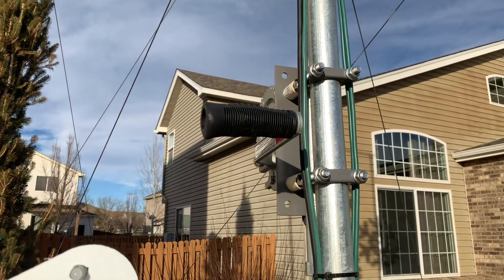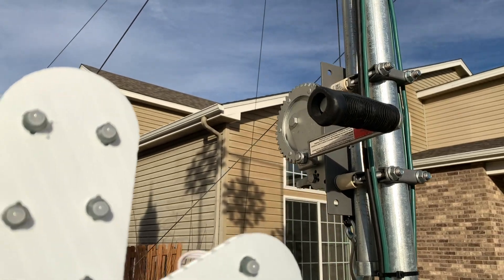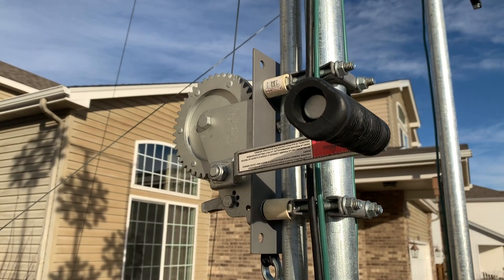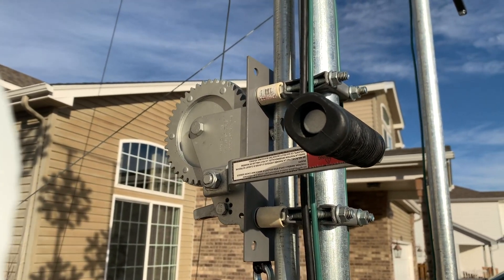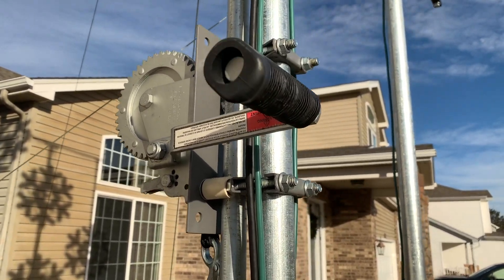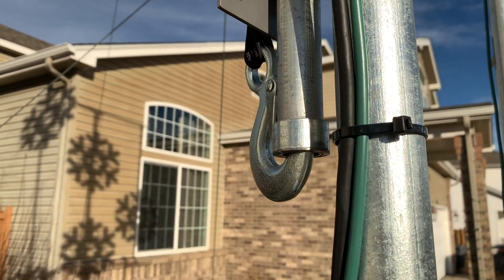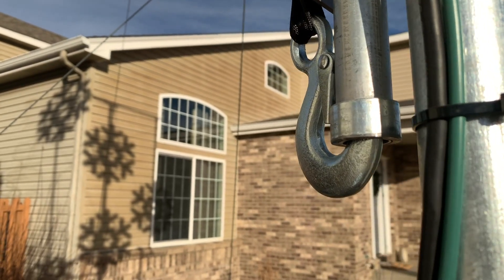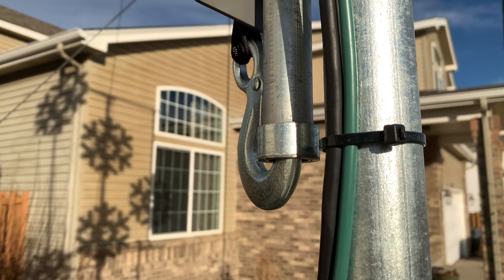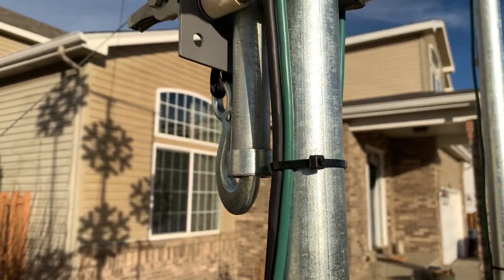This is based on an ASAP pole, so we can see the winch assembly here. This one is a 1,000-pound winch with the mounting plate from Biscollo, and that pushes up on the push-pull, which — just like my Megatree video — is made from rigid conduit and not EMT because that can handle a lot more load. I can put that little metal coupler that comes with the conduit on there and saw it off flush with the end of the pipe to give a lot of surface area on that hook.